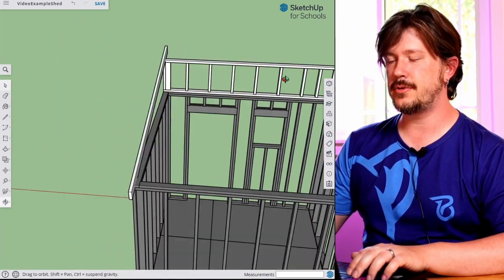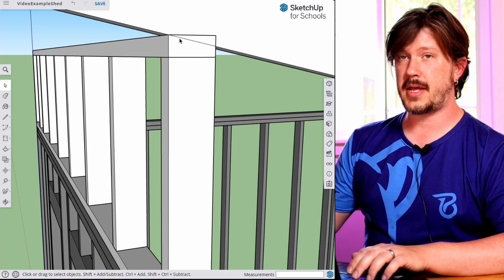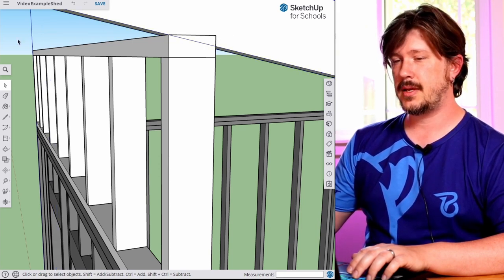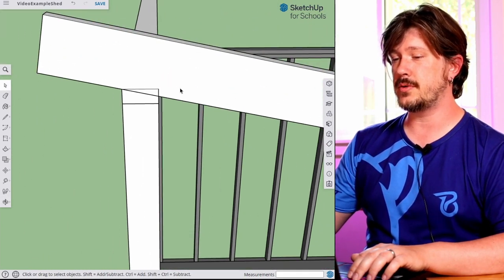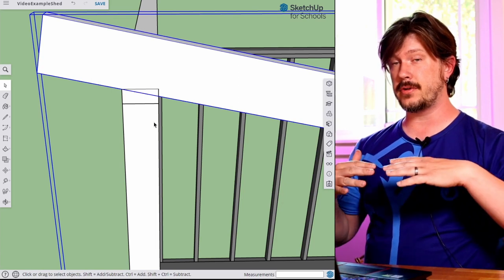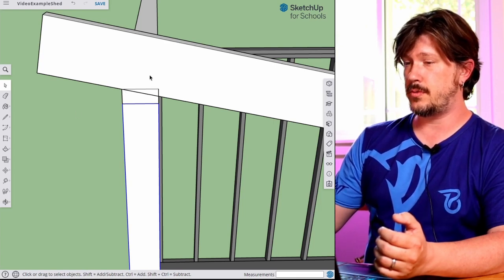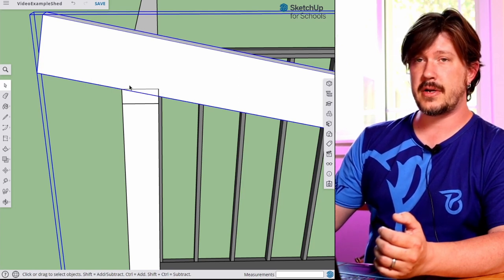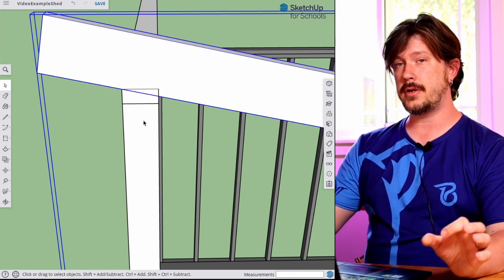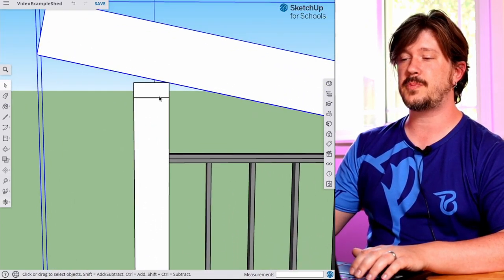So here we go, we've got our 2x6 rafter, and there are some other things we need to do with it. You can see here, we did this on the very edge, and you can see this little overlap right here. What we're going to need to do is notch out this rafter by this amount. That's called a bird's mouth. A bird's mouth is really important in roof construction because when you have an angled framing member on top of a wall, which is typically flat, level, horizontal, this angled piece needs to sit flat on your wall. To do that, framers will cut a notch corresponding to the angle that this needs to sit on the wall. That's very important because you need this rafter to sit flat on your wall. It can't sit at an angle. If we try and sit it at an angle like that, you should be able to tell just by looking that this does not look stable at all.